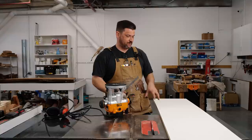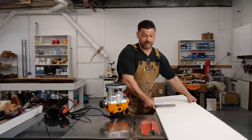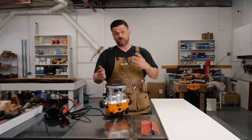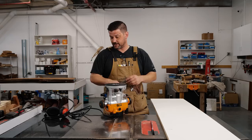My router is about seven inches, so I'm going to make this about seven and an eighth wide. You need to add double the thickness of your material to your width because you want to put the rails on top of it — you're going to glue and screw it, which adds extra rigidity. I chose melamine because it has a slick surface for easy movement, and I know it has a straight edge when I buy it, so I can run it against my fence for straight cuts. Putting rails on top rather than the side prevents bowing and supports your router better.